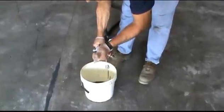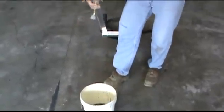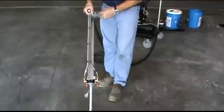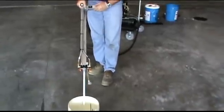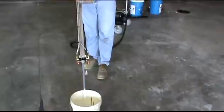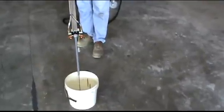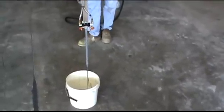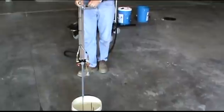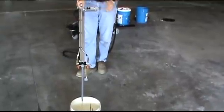I'm going to install the mixing nozzle with the retaining nut. Once that's secured, the first thing I want to do is turn this back to zero, turn the machine on, then start increasing the speed. As you can see, the product is flowing through the nozzle. I can speed it up very fast or I can slow it down to nothing. That's the great beauty of having all the controls right where the operator is.